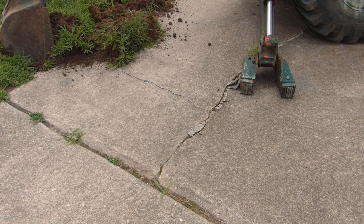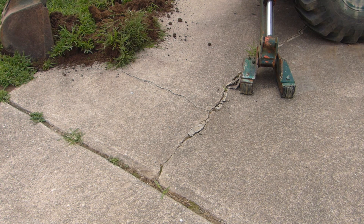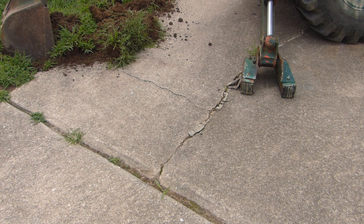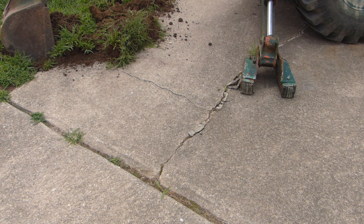Look at this crack right here. The machine cannot lift it up in one break, but watch what happens when you cycle it — same thing over and over again. The cycling causes separation. Just a little bit each time gets you a millimeter further down the road, and eventually it's able to separate. Think of the cycling going on in the bridge deck with that little bit of reinforcement over 40 years, and these cars creating all that cycling.